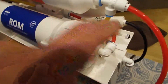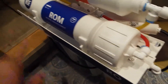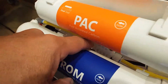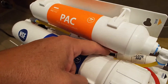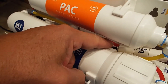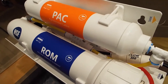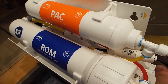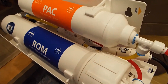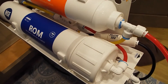To bypass the element, you want to find the drain line which is the line connected to your flow restrictor that goes to your drain — it's this black line on mine. What I'm going to do is disconnect the input to my flow restrictor on the side of the element, put a T there, disconnect the output side of the flow restrictor, put a T there, and then put the valve in between. Let me get that all taken apart and put back together and I'll show you at the next step.